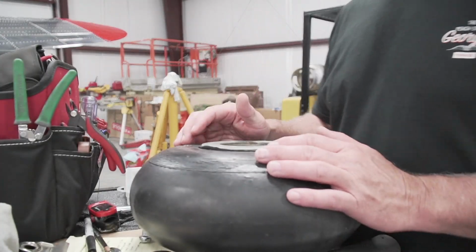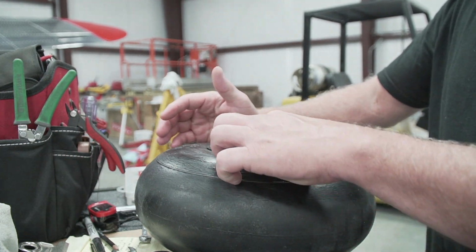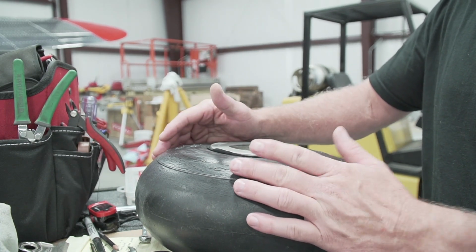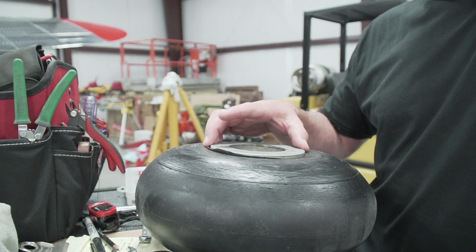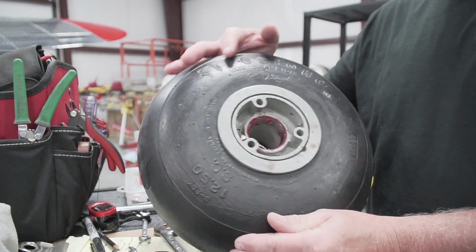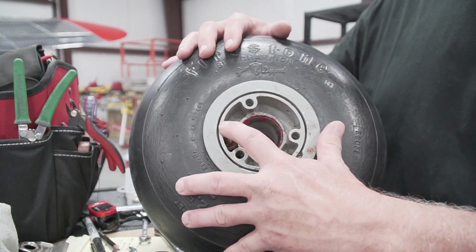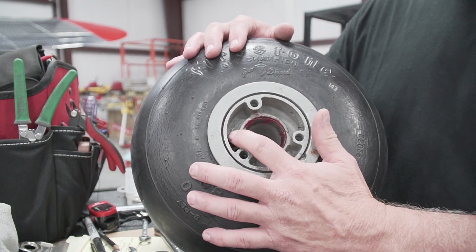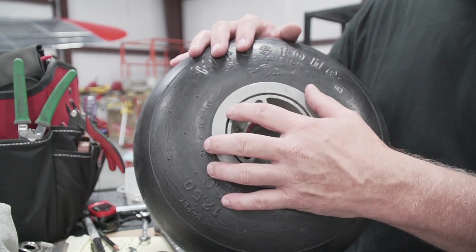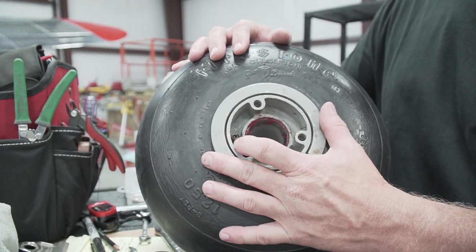So I wanted to finish this video off by explaining a couple things. There's some guys up north, I can't remember where they're at, but they have a Lockheed, and they actually use the tire that I put on the Lockheed just now. One of the things I had to do with that is the valve stem: when you put the thing in and pump the tire up, the valve stem would be pressed up too close to the wheel. So what I ended up having to do is pump it up, check where it's at, bend it, then let the air back out of it, bend it, and then pump it back up and check it. And I had to do that four or five times to get it like I needed it.